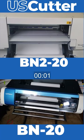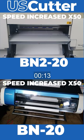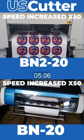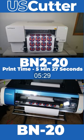The BN220 is on the top while the Roland BN20 is on the bottom. The BN220 has a front-loading design that allows for a heating element below the media exit to help cure the ink for a much faster CMYK print. After a total of 5 minutes and 27 seconds, the BN220 will be finished printing and it will start to dry the ink along the heating element before it starts cutting.